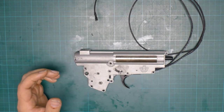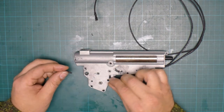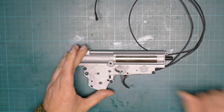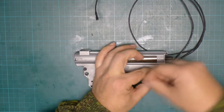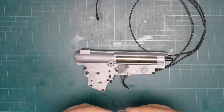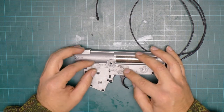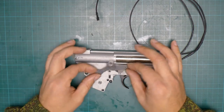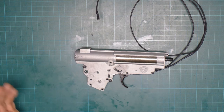Let me put the screws and connect the wires, and then we can check the working. One more step that you definitely must not forget: on the AK you have these pieces that are connected to your fire selector. You must ensure that it still can move freely, so you don't scrape the Titan PCB through this window. Let me finish the cable management — that is for later. Now I would like to connect the wires and do the tests.